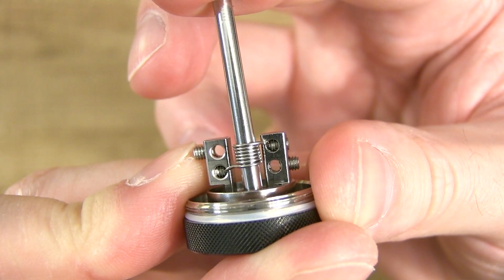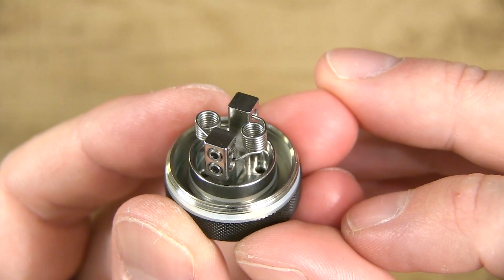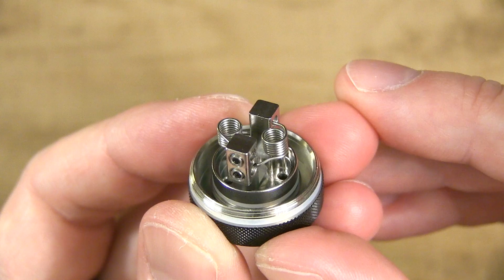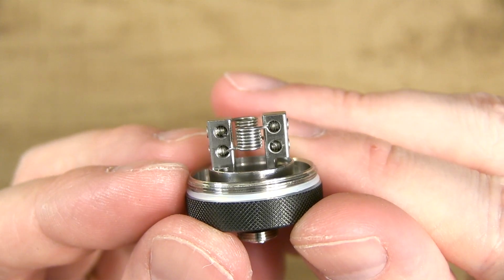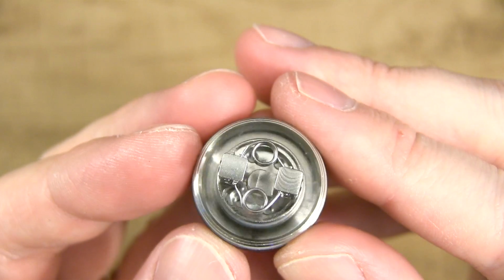What we're going to go ahead and do is repeat the exact same process. Alrighty, so we got our second coil installed, and with the method I just showed you, it's super easy. I tell you, once you learn how to wrap each one counterclockwise, that is the biggest trick to the book for this installation. And if you do it counterclockwise for each wrap, look at it. There's no crisscross. She's going to fit in there perfect. And remember, if you use a bit, it's going to be even easier to do the installation. But look at the clearance, man.